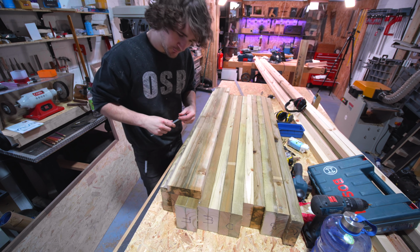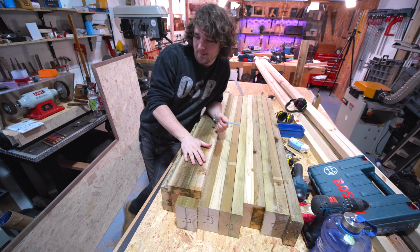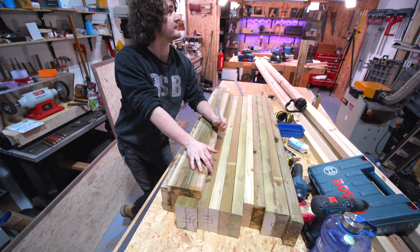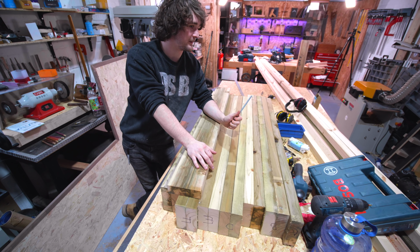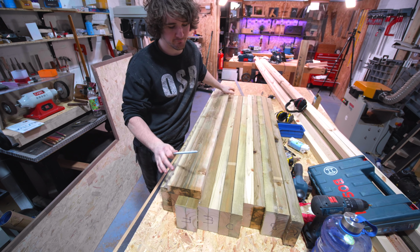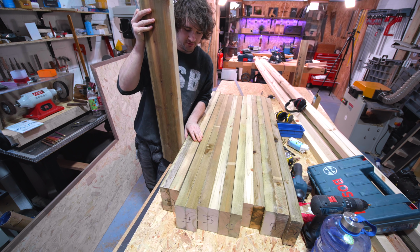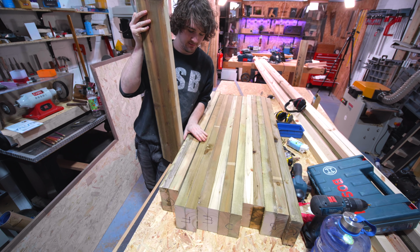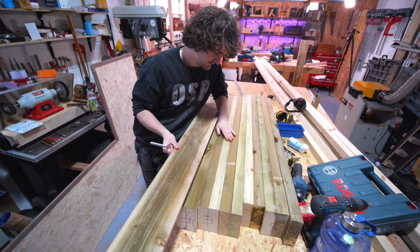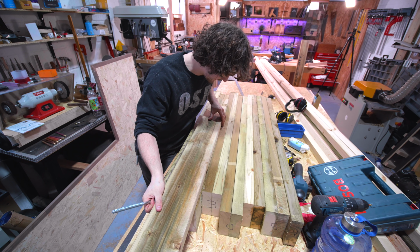So I'm just working out the depth of the counter bore that's going to be going through the baluster. It's a baluster, I think. I think that's the upright bit. Anyway, this is the baluster, looking at it from the side on view, and that is going to be linked into the double joist that we've got at the front, which is basically that thickness essentially. So let's say these two can represent the thickness of the two beams that are up there.